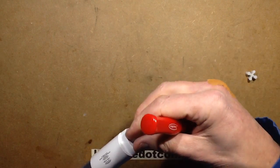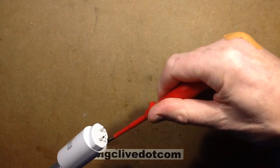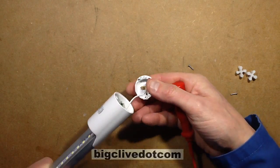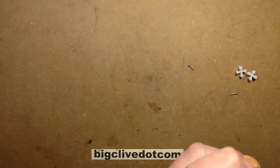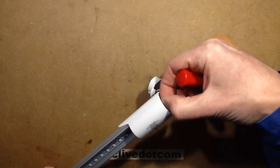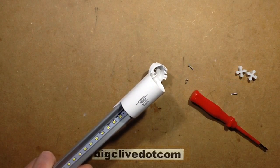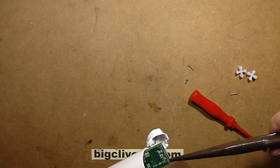The other end has the sensor in it, so let's pull that little cap off. I was quite impressed by the light output at 19 watts - the power factor is exemplary at 0.95. When it cuts down to 3.5 watts it's still quite bright. There's a little circuit board module in here - it's the Doppler module. I'm going to need pliers to get it out.